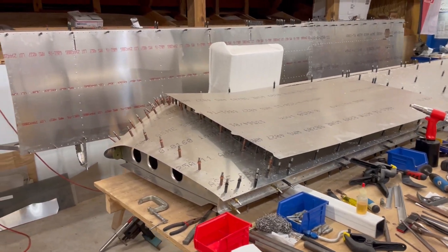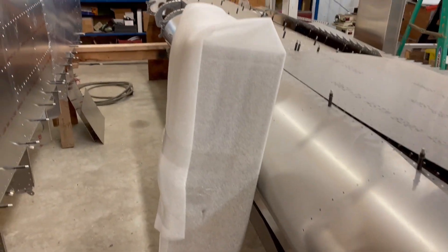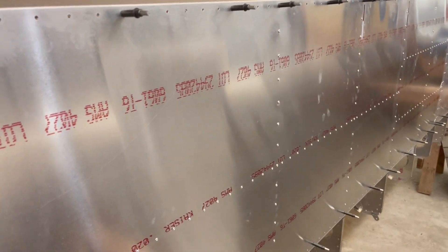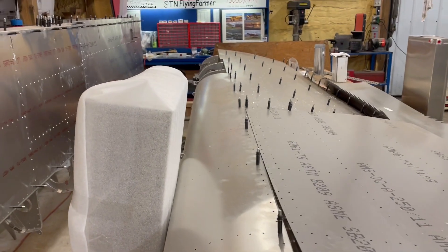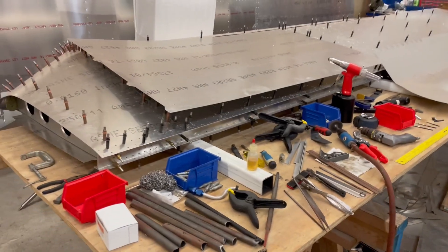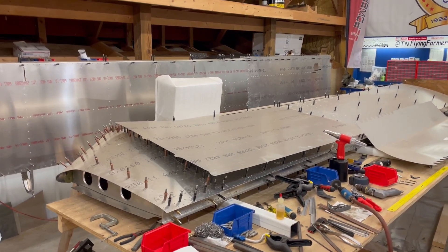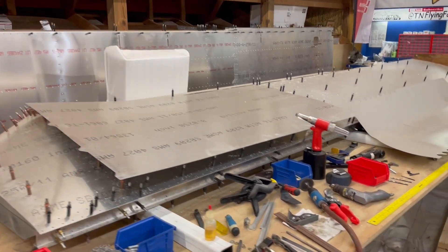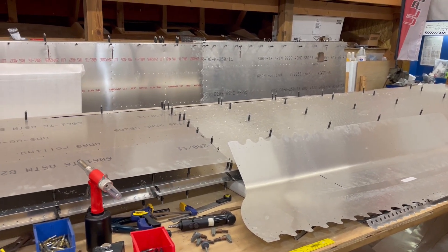I had the fuselage going and then I stepped in and started on the wings. The wings are basically ready for final rivet — all I need on the wings is to put the wiring in and the fuel system. Both wings' skeletons are completely ready to final assemble. You can see I've already got the bottom skin riveted on and it's ready to wrap the front. This one's all been fitted and clecoed, and it's ready except for the fuel system. I've kind of waited on that because I live on a farm and especially in winter months there are mice moving around — I don't want any chance of rodents getting in the wing until I can actually hang it on the plane.